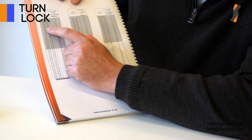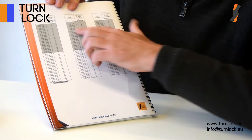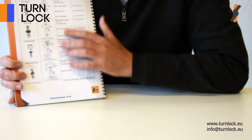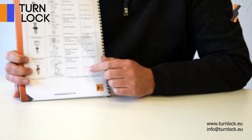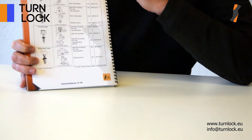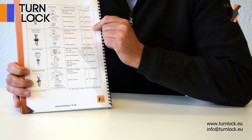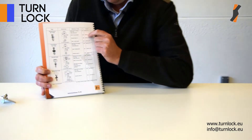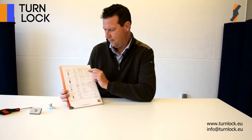If your value is exactly on 5.35, select a longer stud. So imagine we have selected stud length number 6. Go now to the section of the studs. There you have options: a slotted head, a cross head, a wing head, or a knurl head. Depending on your material, choose the appropriate part number. When it ends with S, it is stainless steel; when it ends with N, it is nickel plated; the standard ones are zinc plated steel parts. Your full part number will be MTHTLS-6Z for a zinc plated part.